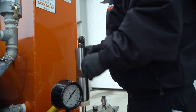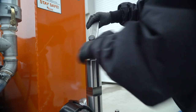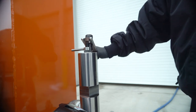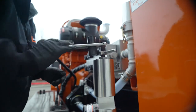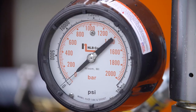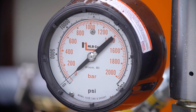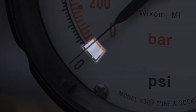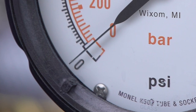The bypass valve is used to set the water pressure. As you turn the valve handle in a clockwise motion, more water will be diverted to the work site. Make sure the handle has been turned counterclockwise to its maximum relief position where the handle is loose by hand, so that when you start the pump you have zero pressure in the system. Once you start the pump, the pressure gauge will help you verify that the pressure is set correctly. Before starting the pump, check to make sure the gauge is at zero. If the gauge needle is outside of the zero band of the gauge, the gauge is defective and needs to be replaced immediately.